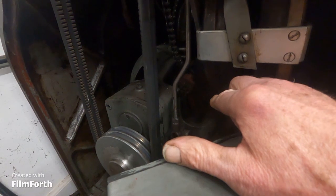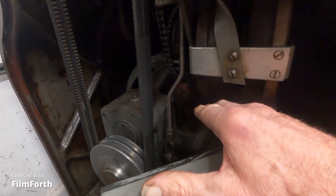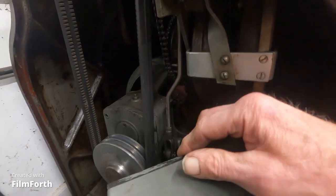An electric DC motor can also turn into a generator. And that's what they do when they throw those coils across the armature. So all that energy goes into those coils and it brings the spindle to a reliable stop in two seconds.